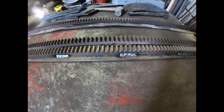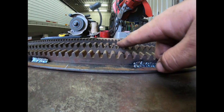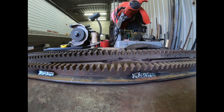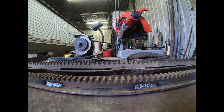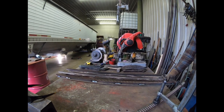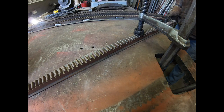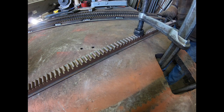I got one all welded up and now you can really see the difference in height between the two. That's how bad the old one bowed up compared to the new one — the new one sitting flat on the table and I can stick my fingers under the old one. That's the problem, that's the issue why these doors are so stiff. All that pressure pushing down on the gears when you're trying to crank it, and with that being uneven, that's where it gets the jerking when you're cranking.